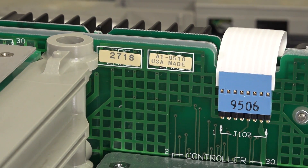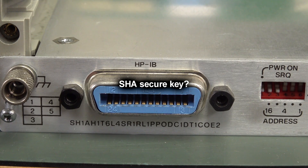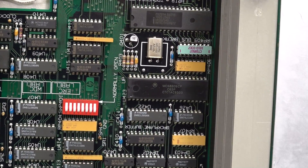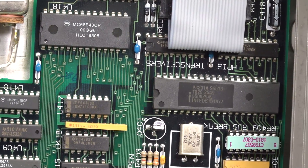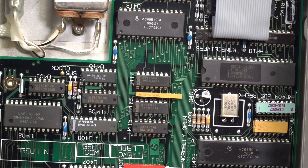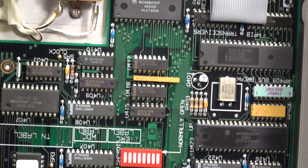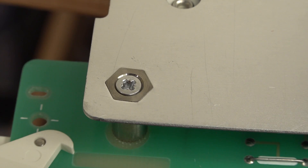Got a big reservoir cap and probably a 7805 or something down there. That's a bridge rectifier — goes straight into the mains cap, and that's all she wrote. Basic full-wave rectifier — it doesn't need much; it's just got to drive the relays and the processor. Just the other side of that backplane — look at this. USA made. If anyone has any clue what those characters are under the HPIB connector there, please leave it in the comments. You have to actually unscrew the top cover — this board doesn't come out as a module. All the 6809 fanboys go wild — there you go. That's our GPIB chip, and the other 6800 support chips, of course. Some memory down there, interface stuff, glue logic, and we've got a ROM. Not a huge amount more — it's just a processor. There's a mains input with an input filter up there.